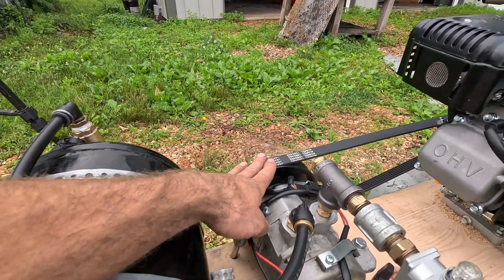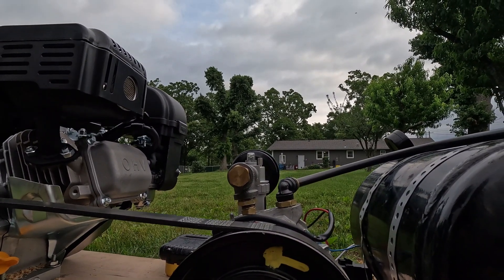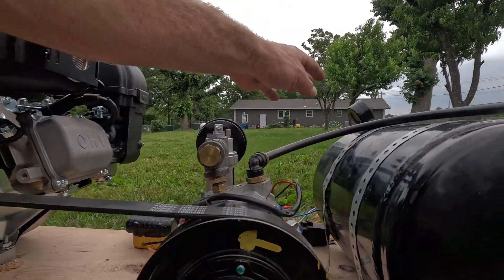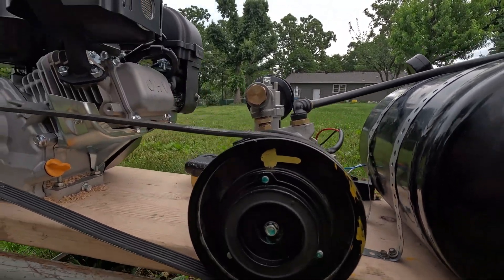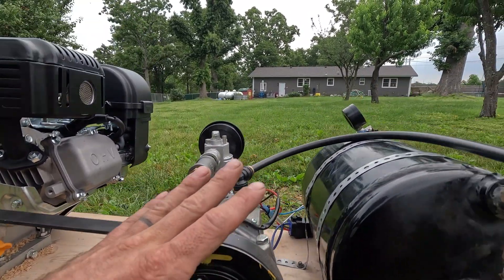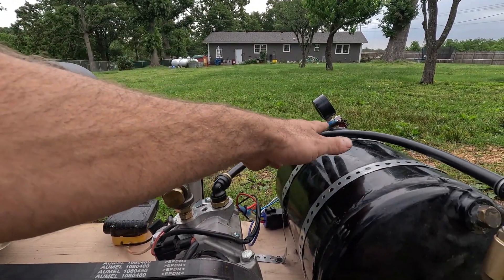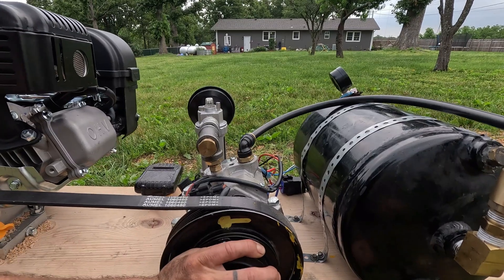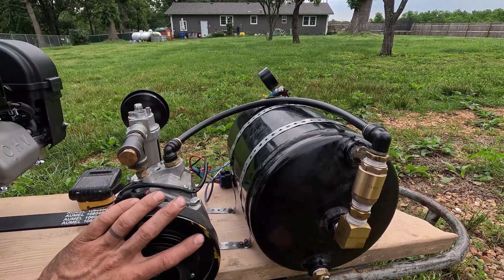Since this AC compressor has an electromagnetic clutch, you can turn the guts of the compressor right now and the pulley doesn't turn. When the electromagnetic clutch engages — which I can flip with this switch — it is now engaged and we are in the driving configuration. The only reason I installed this switch is so that when the engine is off and we are below our 120 PSI threshold, the clutch won't remain engaged. There's no air in the tank right now, which is why the clutch is currently engaged.